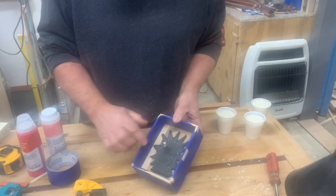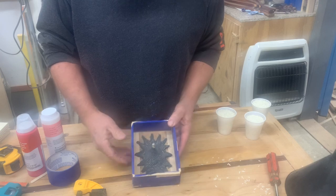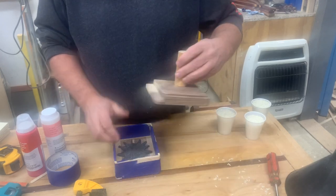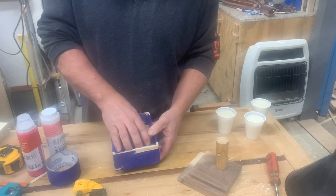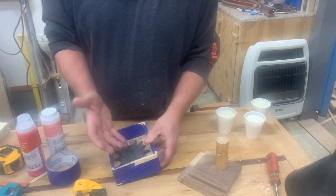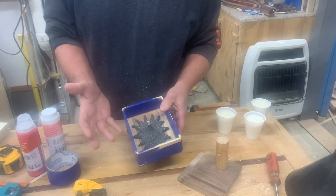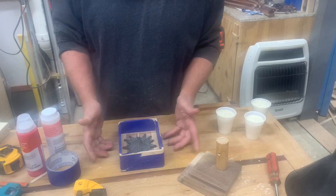A little box for it. Here's the clay mold that we put on here, made it. There's the front — just made a box. We're going to pour in here, cast the mold, pull the mold off, and then we should have this impression inside the mold to pour our epoxy. That's how it works.